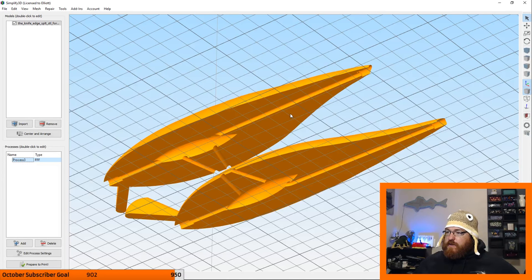And then Rover says matching holes and a print peg at the same time. Yeah, I could see it happening. The problem is that these things are so small that your peg is going to have to be like 2 or 3 millimeters. And then you have to deal with either your brim or your elephant foot potentially. So your tolerances would have to reflect the inaccuracy of the printing process. If I could find a standard that everybody's got around the house, then I could model it just 0.2 millimeters above that, and then we won't have to worry about it.